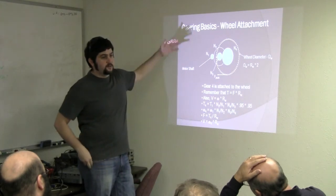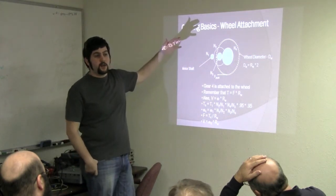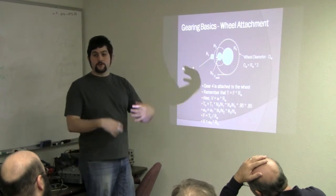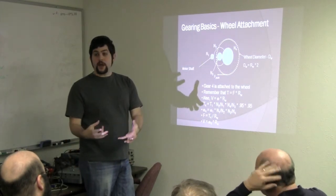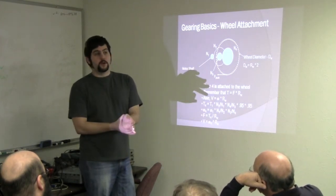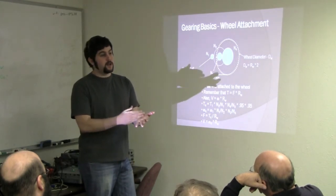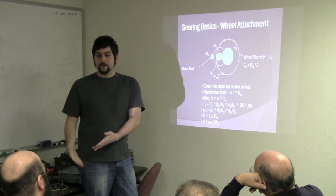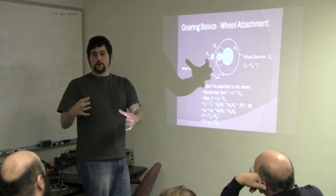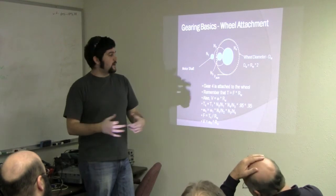I mean, this is basically what I've presented, I wouldn't say in the order of my preference, but I always try to stay in the spur gear chain drive world if I can. And then you start introducing the other types of gear trains if you have to. Mostly that's because anybody in this room can build a spur gear drivetrain or a chain drive. You start getting into Planetary gearboxes, bevel gearboxes, worm gearboxes, you kind of step beyond the realm of the average person to build one from scratch. But there are plenty of commercially available ones, so it kind of all depends.